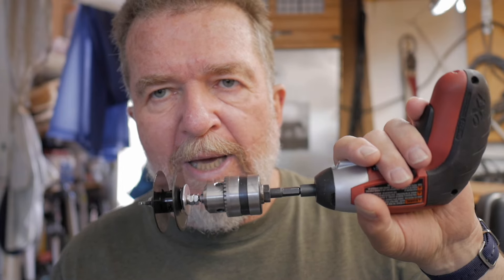I saw online the other day that Lucas Duel from Chicago Typewriter posted a video where he built a ribbon dispensing station that holds the reel of ribbon in a vertical fashion. He actually used Erector Set parts — an American version of a Meccano construction set — to build this vertical system. He was using an electric motor off of an old 6-series Smith Corona, running a rubber roller on it. All you have to do is touch the rubber roller to the rim of the typewriter spool and it turns it. My new system is going to be more like what Lucas was doing, but instead of a dedicated motor I'll be using a portable battery-powered screwdriver.